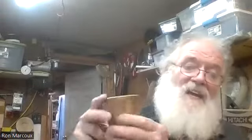I have a spindle tap as well. So here's something that I can use to push against a finished piece and not mar it if, for some reason, I have to go back in. I use this when I do spheres and stuff. And here's a friction drive, but it's relative to the spindle. Put it on, make it round, and you can use this for removing bottoms, whatever, as a friction drive thing.